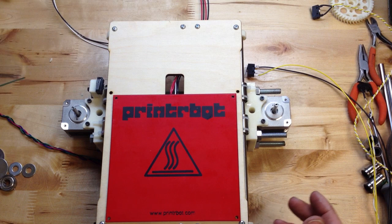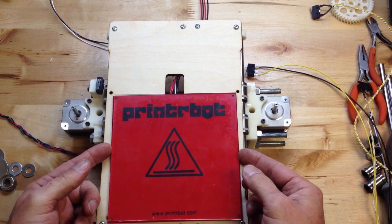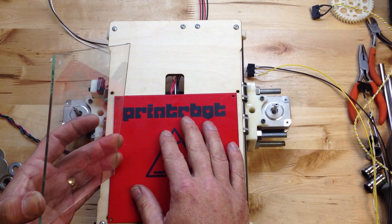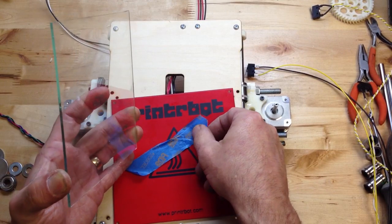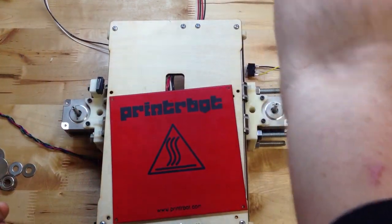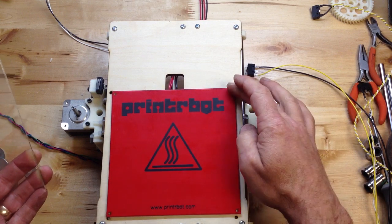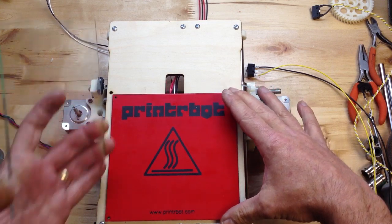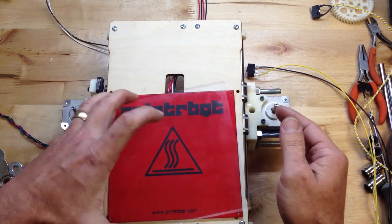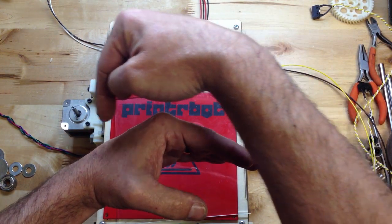Some people have commented asking if I'm sending glass. I'm not going to send glass for a couple of reasons: number one, it's hard to ship; number two, it cuts people, and I don't really want that liability. Instead, it will work if you put blue tape. Get the kind without writing on the blue — this blue tape with writing on it is junk. You just want plain blue tape. You can print right on blue tape — it's the first thing I printed on. The reason I like glass is these boards aren't perfect; even bolted down on the corners, there's still going to be a slight bend. When you go to print, the print head will be further away from the board, then close at the top of the bend, then further away — so that's problematic. That's why I use glass.